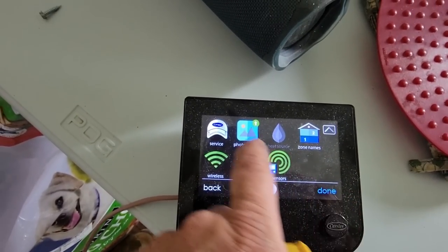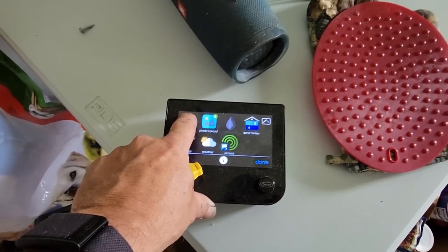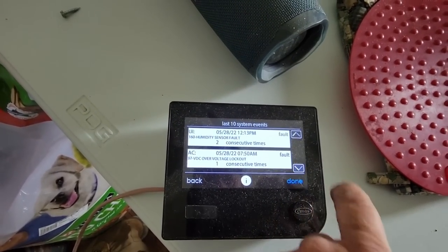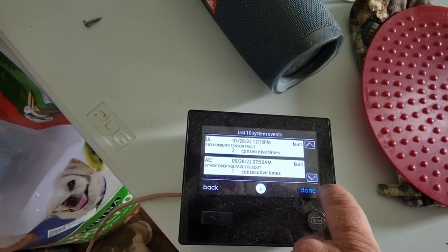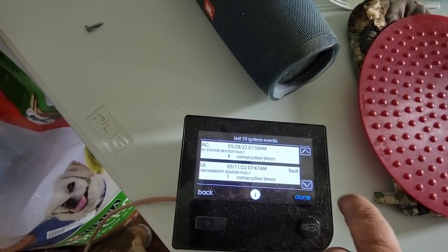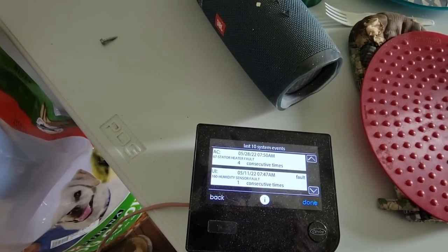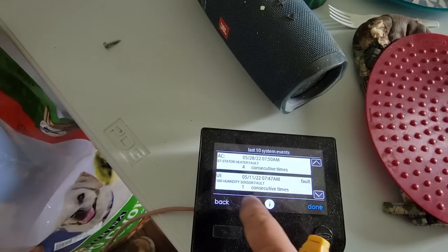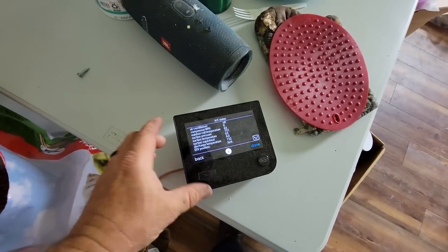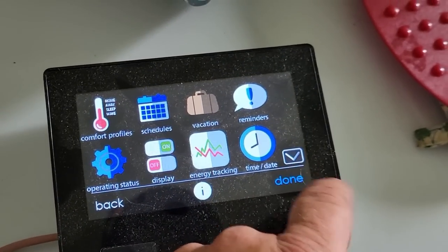He said he had a code too, some other weird code. I don't know if it was the inverter or what going on, but let's take a look, see what code he had. Warm up display, low pressure. Humidity sensor fault, DC overvoltage. Yeah, one time. Stator heater fault, that's a little weird. Maybe it's because it was low on charge. Humidity sensor fault, that's great. All right, so the stator thing's the compressor, probably getting too hot because it didn't have refrigerant. All right, well, we're gonna put this back to normal.